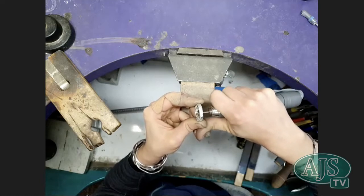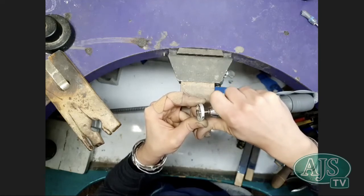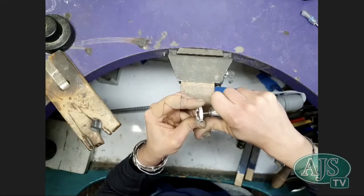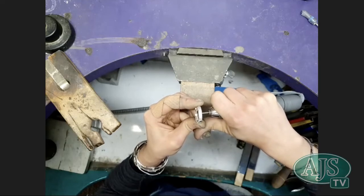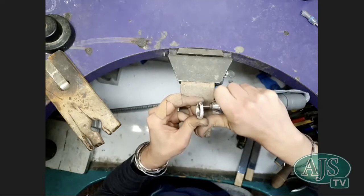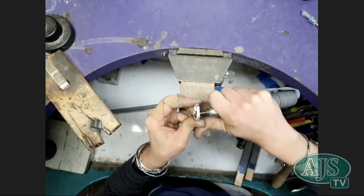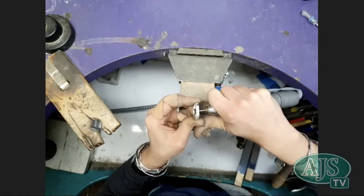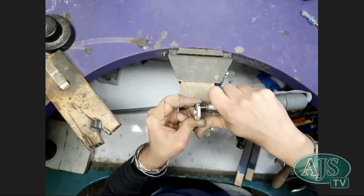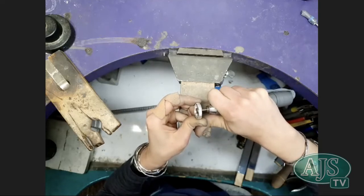So I'm just running along the inside, which is why you want to stay in the one direction. You wouldn't want to change directions because you've just dragged all this metal from one side over these holes. And then if you go from another direction, you'll start dragging the metal in the opposite direction over. You've just spent all that time dragging it from one direction over the hole, coming from the other direction. Yeah. I don't know, there's all sorts of ways to do things. That's just the way I was taught. Maybe there's not a problem with coming from the other direction. I was just taught that you stick to one direction. I'm just going over the inside of it. So I know where the little tool has been because the metal is going shiny because it's been burnished. And there we go.